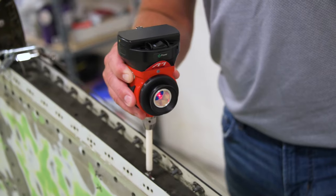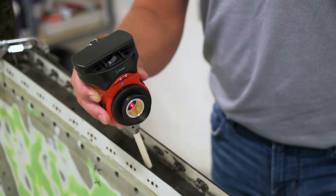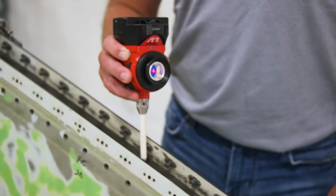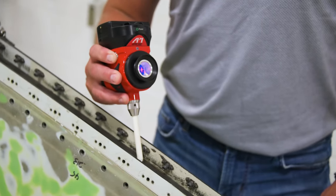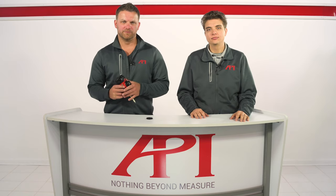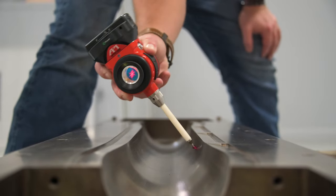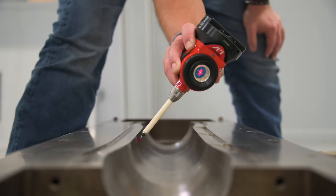But the distance is only half of vProbe's calculation. The SMR inside vProbe can move in multiple directions without the probe tip moving. This would change the SMR's distance to the tracker and allow for multiple values to be measured at a single point on the part. To compensate for this SMR movement and the angle created by the user's hand, vProbe has multiple internal levels to calculate how far off center in each direction the housing is. This offset combined with the length of the probe tip gives vProbe an absolute position for the SMR in relation to the probe tip.